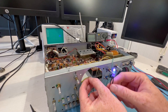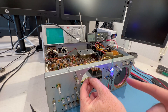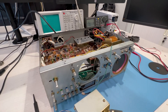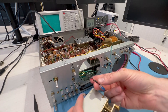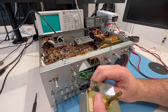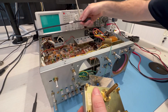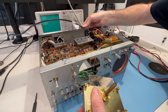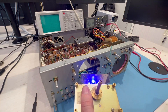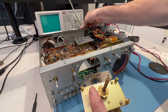Bingo! Let's try to see if we can get that LED into the VFO — which we will be able to. Desolder it and see how it looks. This is just for testing, so don't attack me in the comments. Look at that — it might be too bright; we might have to put a 1k ohm resistor in here, but we're going to test it and see.